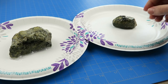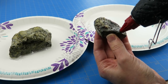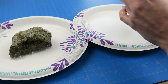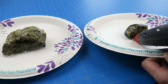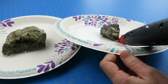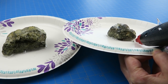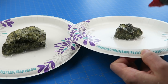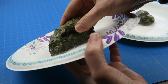Even though the mold has undercuts, the first step was to apply some glue over these rocks just to make sure there's not any grit left on them. Even though I washed them, I just wanted to seal that and fill in any small holes so that the molds will come out nice and neat. I'm using hot glue to glue the rocks onto some paper plates — this keeps the silicone from getting underneath and keeps things neater as we add layers. I filled in the cracks pretty well with hot glue so I wouldn't have too much trimming once the silicone cures.